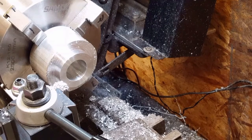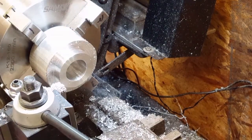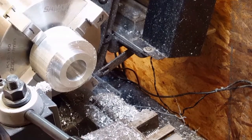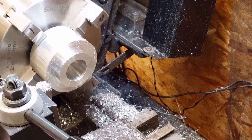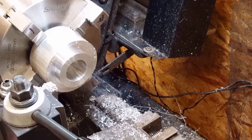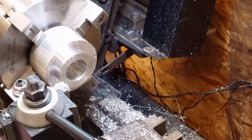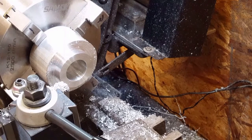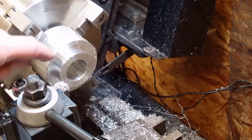I am going to turn it in just a little bit to make this last cut. So that's 20 right there, and I want to back-cut this wall. I don't remember now — there was 5 before, now it's almost zero. So I gave it ten thousandths to go ahead and cut that back wall. I'll run that back up to the 20 mark, get close here. That should be right where I was at. I'm going to give myself a few thousandths to cut, and when I get back to this wall, I'll feed in then feed out.